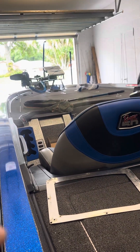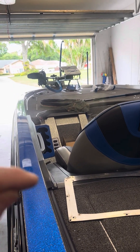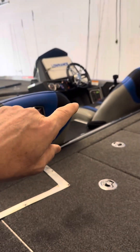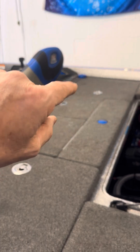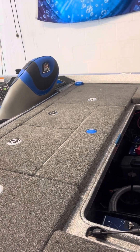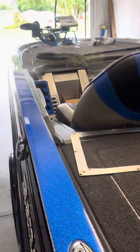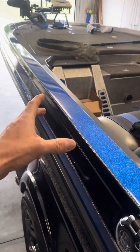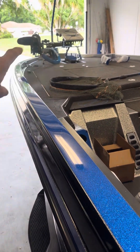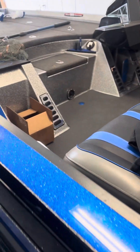With the upgrade to my bow package electronics, I needed to run a dedicated eight gauge wire up there. I tried pulling fish tape through the PVC — attempting to push it from behind the driver's seat — but there was too much diameter in that tube and I could not pull it through. After about two hours of that, trying from the rear forward and from the bow to the back, I gave up and started on the port left side. The fish tape from the front would just come out somewhere midway and I could hear it spiraling on the floor of the hull. I was just frustrated.